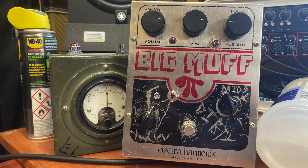Underneath there to the left we've got our standard true bypass control. Above that you've got a little flick switch which lets you swap the diodes so you can get different clipping options. To the left of that switch you've got a tiny bezel — it's actually a blue LED in the clipping circuit that lights up when you play hard enough, which is really cool. Then to the left of that underneath you've got the lightning bolt control, which is actually a gain stage and bias control for the first input transistor — you don't really see that very often.